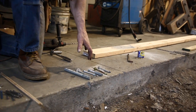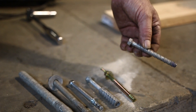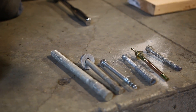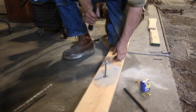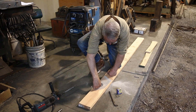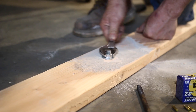What I have here are six permanent, or at least essentially permanent, attachment methods. Three of these are wedge anchors. This one is just to demonstrate that they get pretty big — this is a Titan; I'll drill a hole and that'll thread itself in. This is a long lead shield and a lag bolt — about the earliest technology for threading a mechanical bolt into a hole in concrete. They work on similar principles where, sliding into a hole, they then swell and resist draw-out quite a bit. I'm going to put a crescent wrench on there, tighten it up, and as the threads pull the bolt out, it's going to gradually come tight in the concrete, increasing resistance, beginning to embed the washer into the wood and compressing the concrete at the bottom of the hole. Nice connection.